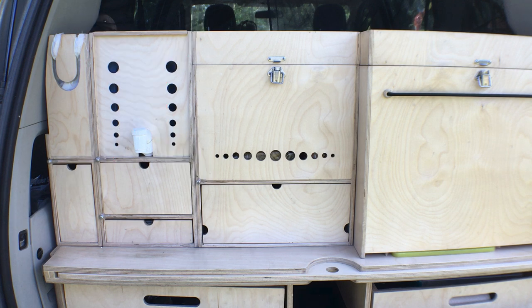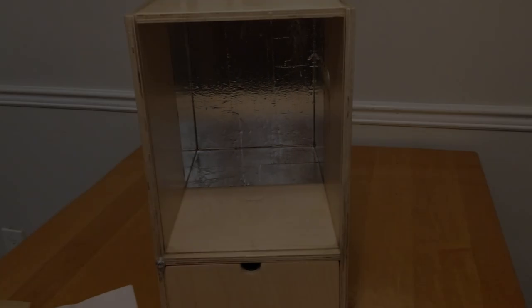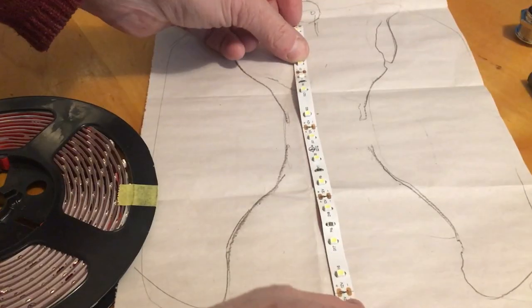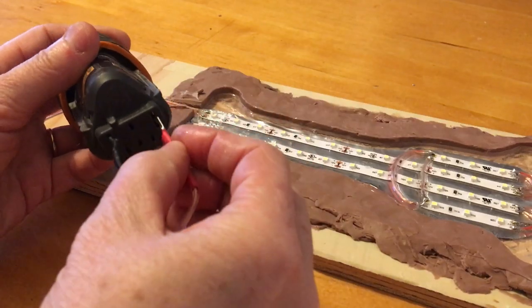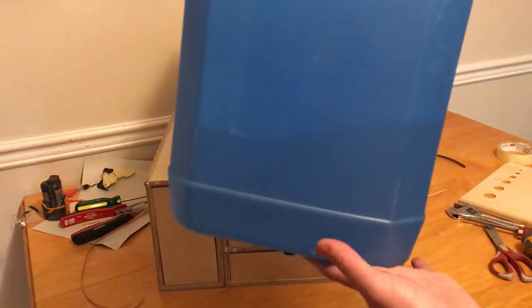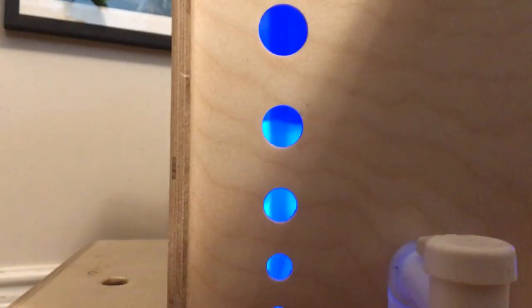The water box is problematic all around. The first issue is that I made these cute little holes to allow me to see the water level, but once it is in the closed box, it is much too dark to see anything inside. To try to fix that, I decided to put a light inside the box. I lined the back of the box with metallic foil tape, added a switch, cut small pieces of LED light strips to fit where the bottom of the water jug was recessed, and soldered the connections. I encased the whole thing in clear resin to make it completely waterproof. I installed it in the back of the box and wired it up to its switch. And it was too bright, which made it hard to see the water level for a whole different reason. In the end, I stuck foil tape over the main strip of lights, and that brought down the brightness enough to get a better contrast between the empty and the full parts of the water jug.